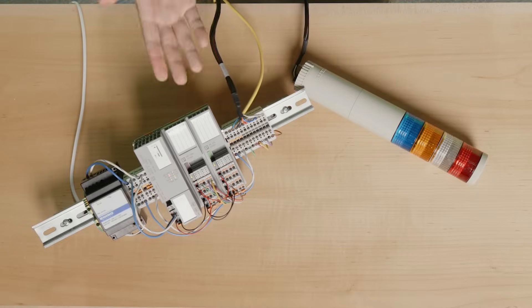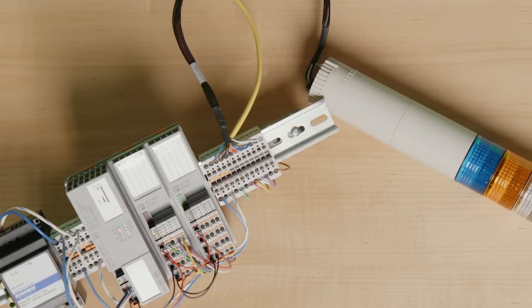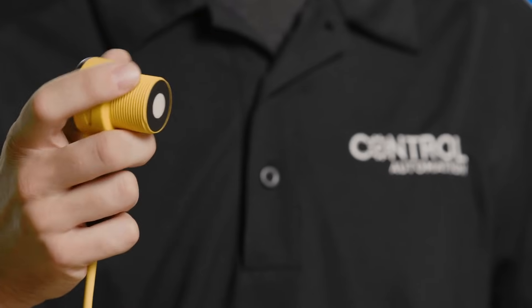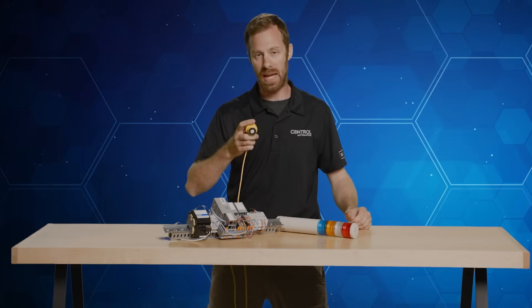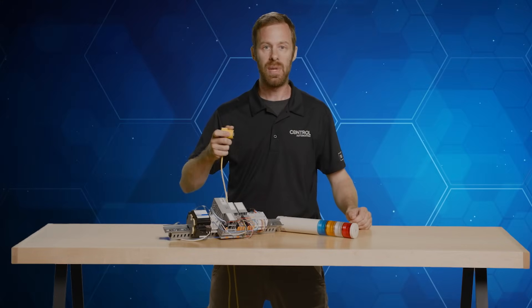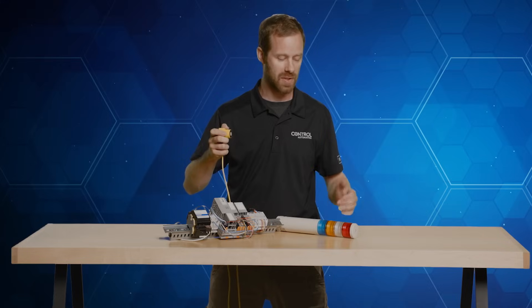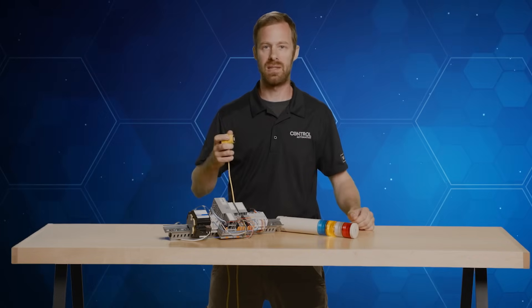In our setup, this PLC is set up to record 4 to 20 milliamp analog input information. It's also set up to receive one digital signal. We can set the threshold of the discrete signal to train the sensor — or teach it — when the appropriate distance is reached to turn on the signal. One of the nice things about an analog signal is that we do not need to worry about a threshold, because we allow the program in the PLC to take care of the appropriate trigger actions when the right distance is achieved.